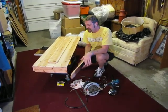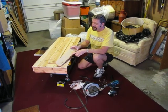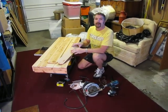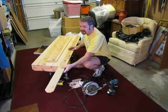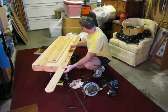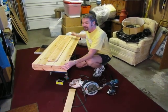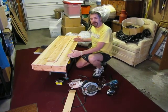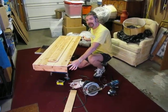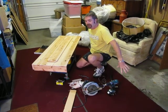Now the fencing material usually comes in 5 or 6 foot lengths. They consider this a 1x4, and it's actually a little bit under that measurement. But what I did is, as you can see here, this was a 6-foot piece. I trimmed it all off down to 52 inches. Now I wanted it 52 inches because our window's 44, so I wanted to leave at least 4 inches on each side to be able to hang my drapery panels from.